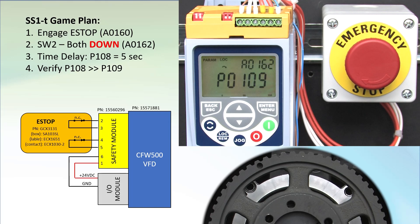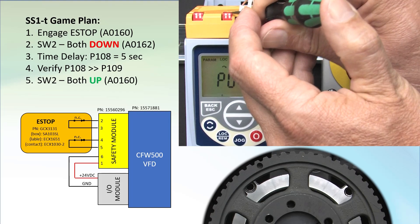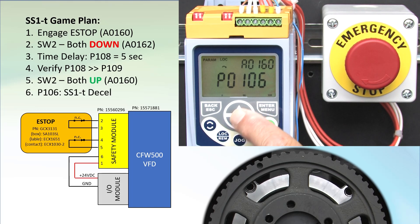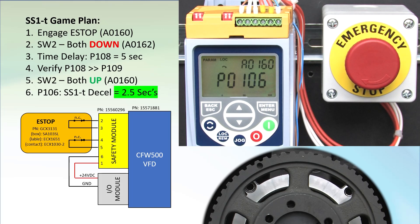That's just forcing us to make absolutely sure that's the time window we want, and the display stops flashing to tell us we're done. Move both of switch 2's switches back to the UP position to end the setup. Finally, we need to tell it how fast to decelerate the load. That's a special decel ramp in parameter 106 — we want that to be 2.5 seconds. Enter to accept. Escape back to the top level.